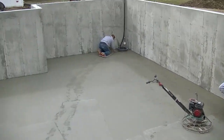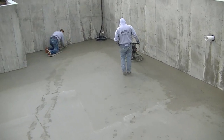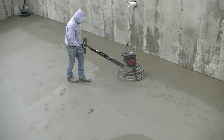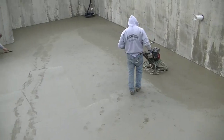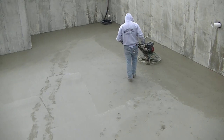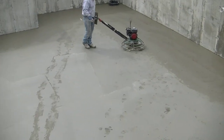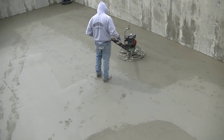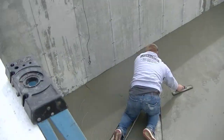Luke's getting on there with the knee boards and going around to hit that part that's been in the shade, because it's just not dry enough to hit it with a power trowel yet. He'll get that shaded spot all magged out — if you don't have to hit it with a power trowel it'll dry a little better if you just do it by hand. Then eventually it'll be dry enough for the power trowel. You can see Darren's starting to float with the first truck — his finish pattern is always to the left, and then he drops down.